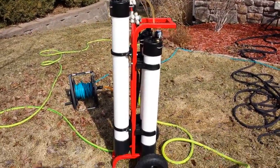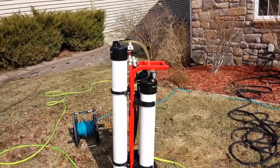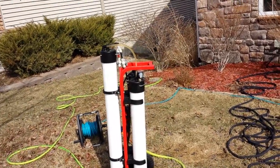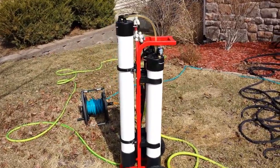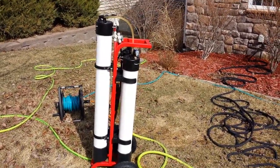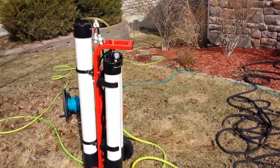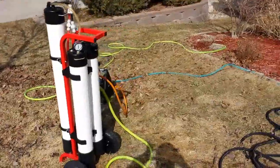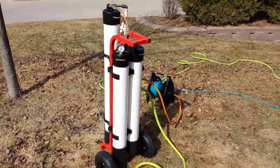So all in all, I'm very happy. I had over 500 TDS at this house, and coming out of the RO I was getting a reading of 20. Cold water tends to drop your RO efficiency, but here I was getting really good efficiency. Very happy — nice sized carbon filter, great sized DI. I'm not going to have to be changing that thing out all the time like I would on a smaller system.